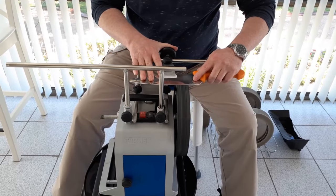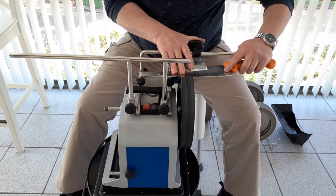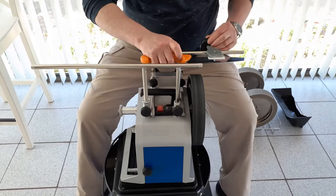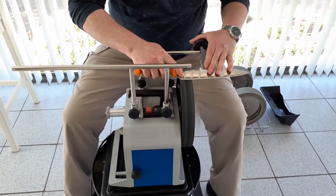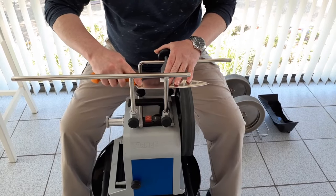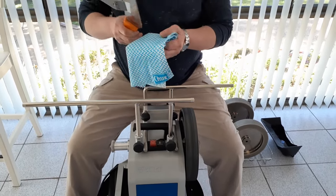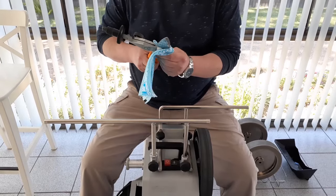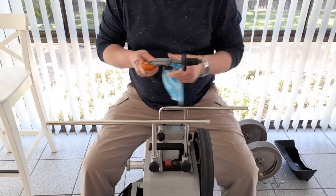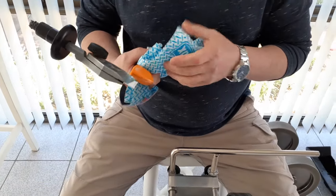Do as many passes as needed till the burr is no longer visible to the unaided eye and you cannot feel it by brushing your finger across the edge. Typically it takes 3-4 passes each side to remove the burr. Now let's check the sharpness.